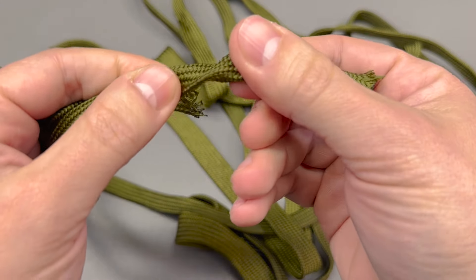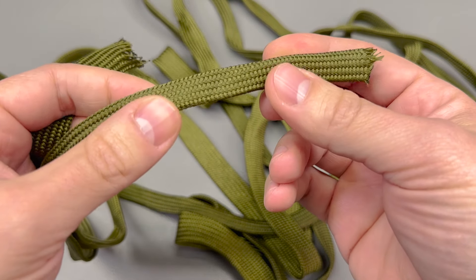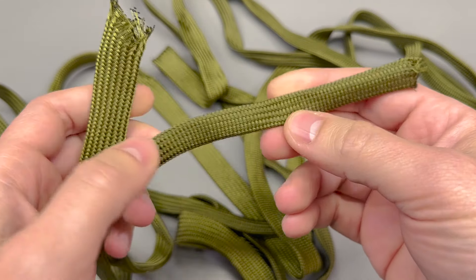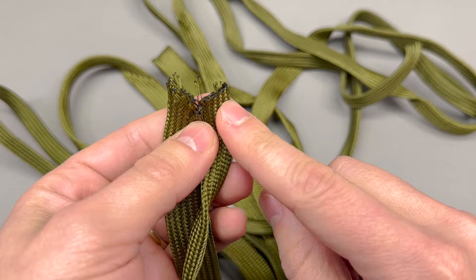But why does it have a third wire, you might ask? Well, this particular model also contains an LED inside the switch which is wired to one of the 12-volt pins that powers up after you turn on the ATX PSU. So this will also visually signal that the power supply is on, which is very neat.